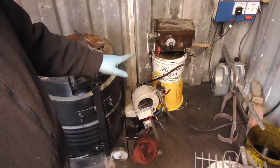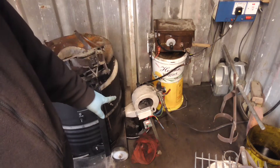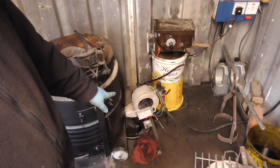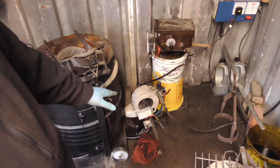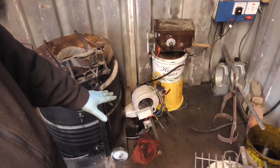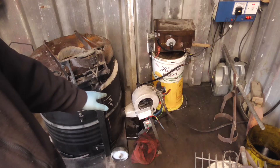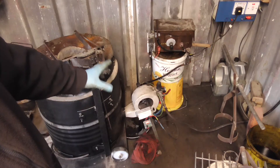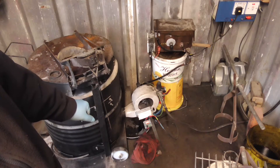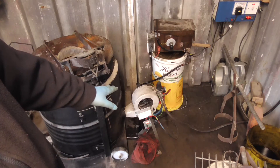So I've just put the heater in and I've connected up the power supply for it - it's just a crocodile clip. I've got the temperature set to about 35 degrees on the heater block. Never had a need to turn it up any higher than that, ever since I've done the conversion. It works quite well. So that gets the block nice and warm, and as soon as I turn the tap on the oil will start to flow through it. So hopefully all the fresh oil that goes through that block will warm up. I always have it just tipped up in that pan so any residual oil just runs out. So when I turn the oil on, the fresh amount of oil starts to get warm straight away. There's no cold oil in the pipe work.